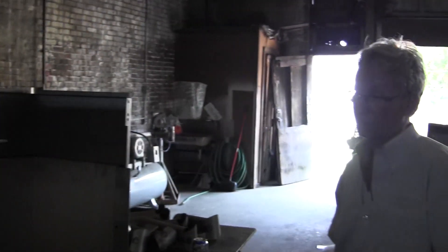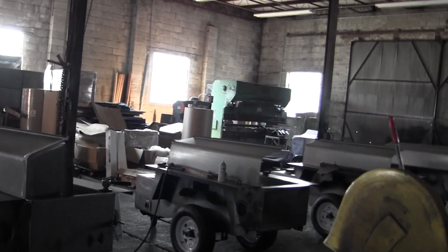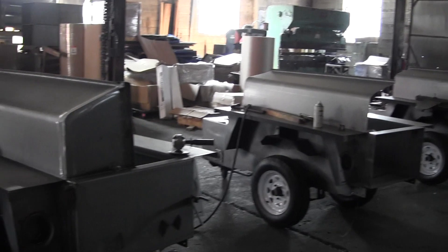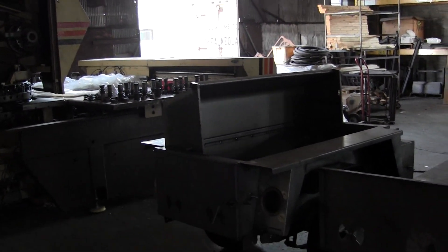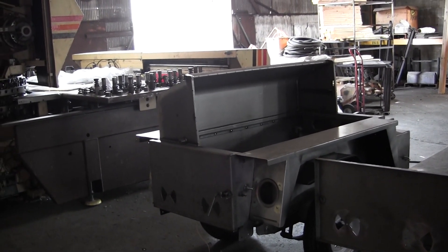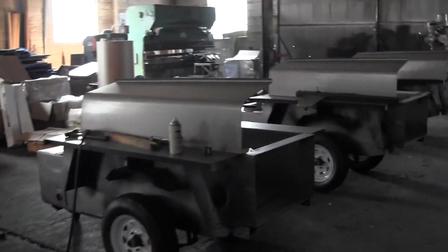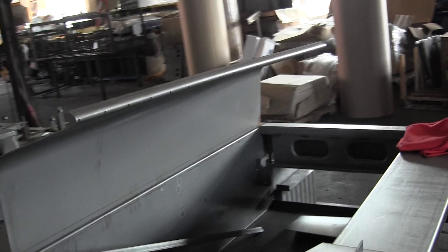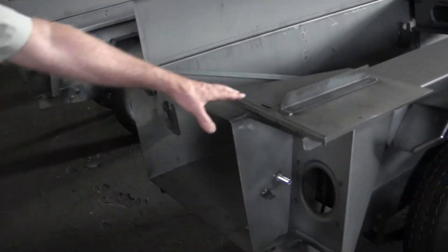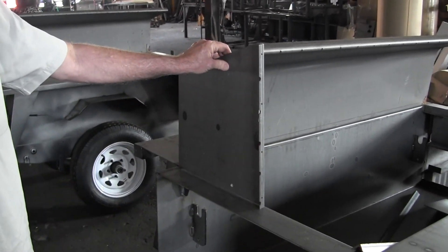Painting is one of the more difficult things. What we do - and I can show you better on one of the grills over here - once we get these things in the manufacturing stage, we build them upside down in a fixture, then we paint the bottom of them, wire the bottom, put the axles on, do everything we need on the bottom side while they're upside down. Then we flip them over and they come out like that first one you see up there - it doesn't have the doors on it yet or the insides.